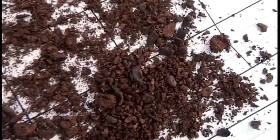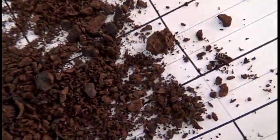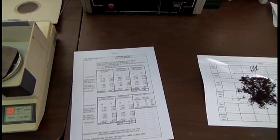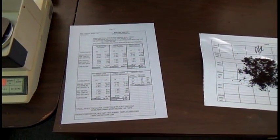It probably ties into the material. This is the as-received material — there's a lot of fine particles, there's dust in there. Also, a surprising number of large particles; the grind was not a real uniform grind. I think our problem came from probably the excess of fines — we just couldn't squeeze the water out. What this tells us is that if we do supply a press for this material, we're going to have to have a strong taper to the shaft to achieve extra compression and extra squeezing in order to get all the moisture out.